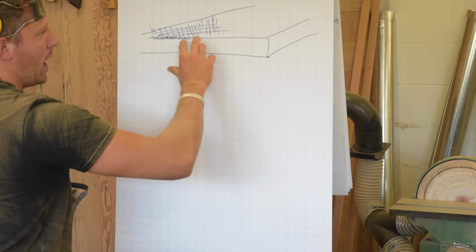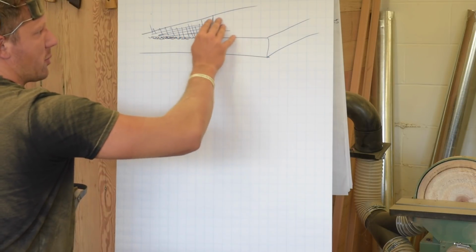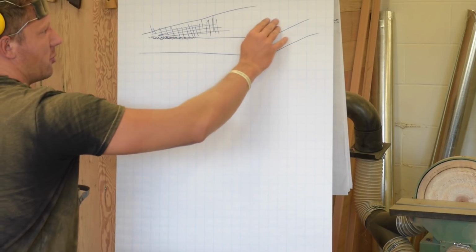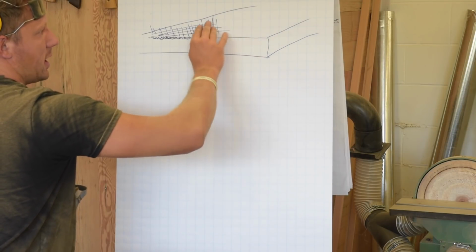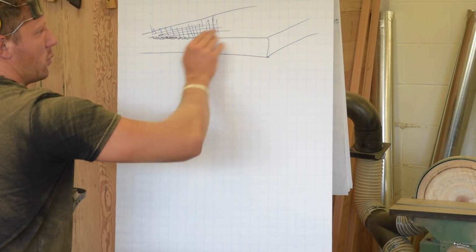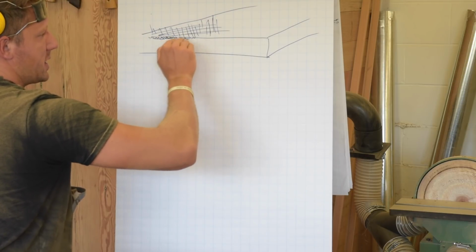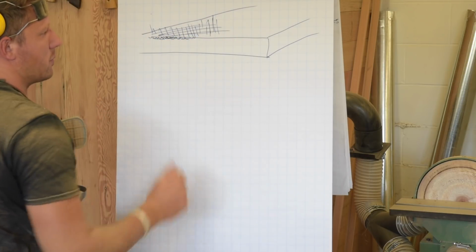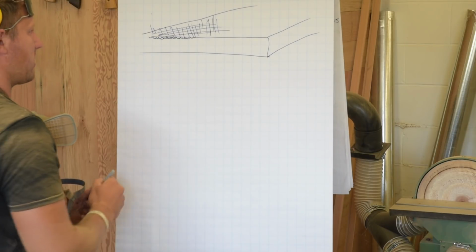This is why a lot of people do a figure 8 pattern when they're sharpening their blades on a sharpening stone, because the scratch pattern is then changing countless times and you're removing material a lot faster than, say, just going in one direction and digging these grooves a little bit deeper and removing less material over time. So that's a little sanding theory for you guys.